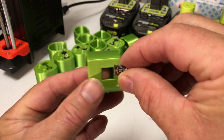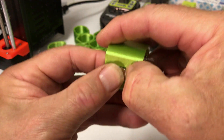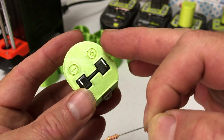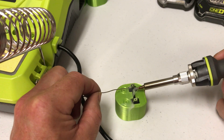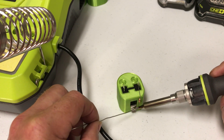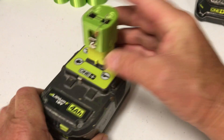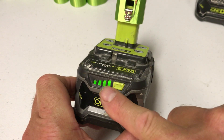We have the little spring clip — just slide it in over this and press it into the hole. We have a 1.2K resistor that goes between the temperature contact and the plus contact. We've installed the resistor and now we just have to solder it. Once soldered and the block is on, the charger circuit is enabled and it shows you how many bars you have.